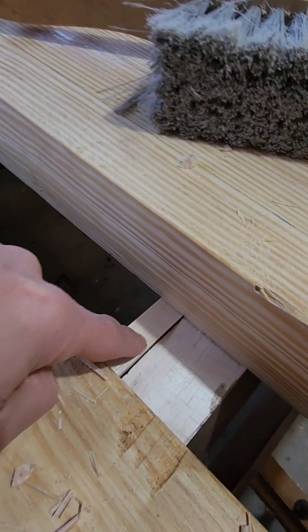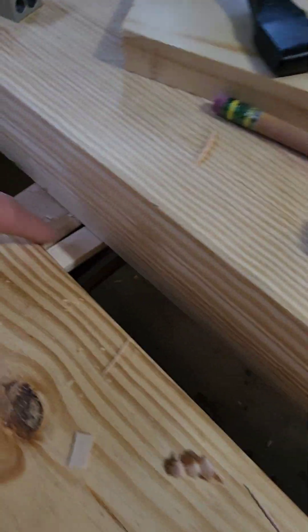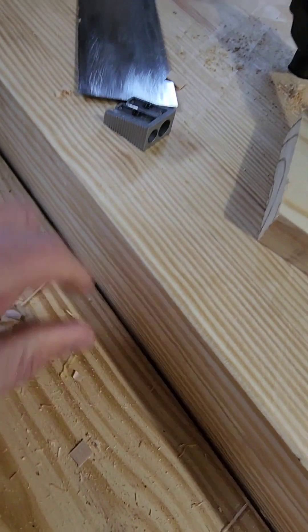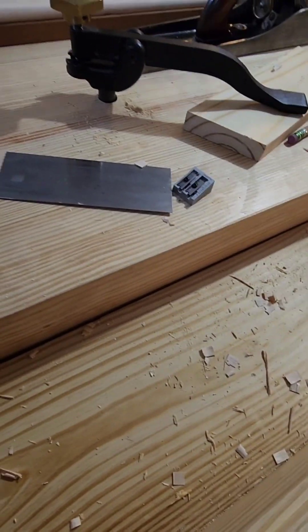There's a bar here that sits next to the top stretcher of the leg, and there's another bar here. This little strip of wood is screwed in on the underside. If you look on the underside, we have the maple leg protruding out from the stretcher, so that allows the bar to rest in place and you can't pull the tray out. I left a little bit of room here so that when the tabletop expands with humidity, it's not going to cause things to buckle.